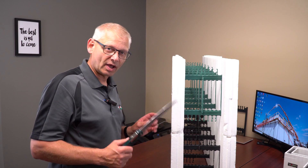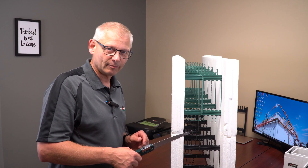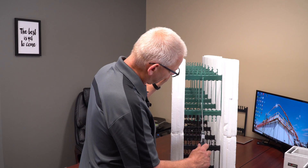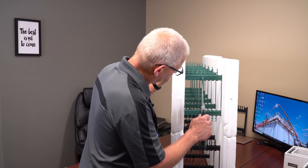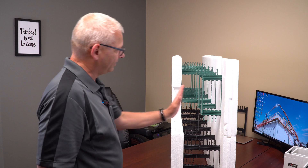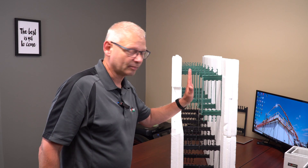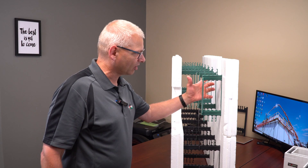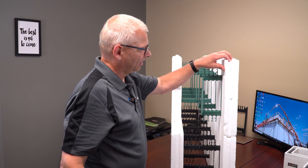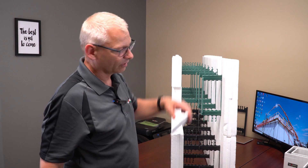I'm going to do a 16-inch high curb. If you have a floor choice of 16-inch and you want to have a curb on the outside of it, this is how you would do it. You would make your cuts on this plastic, cut it down, and right along the face of that curb — and this is what you would end up with. Now I have a surface to screw some plywood onto, that's the whole point of the curb. Once I have that screwed on, it's strong enough to accept concrete. I would probably cut a taper in the top if needed, and as long as it's more than a 45-degree angle, you're going to meet the engineering for it.